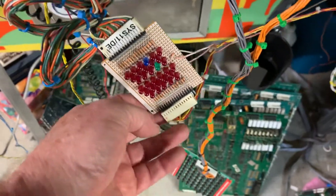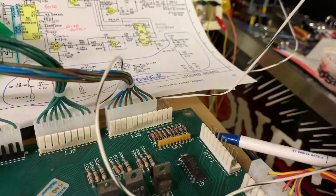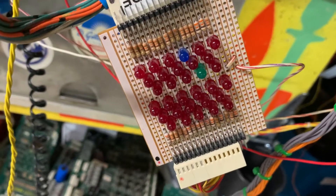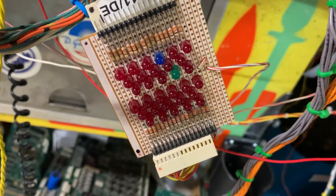System 9 didn't have circuitry to control the special solenoids, but I'm going to rake a ground wire across here just like that, and we shall see the special solenoids fire: one, two, three, four, five, six — those are all your special solenoid inputs.